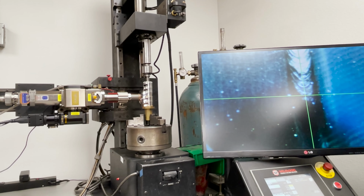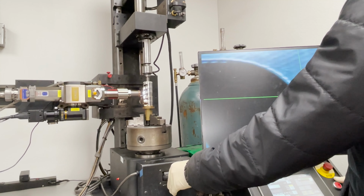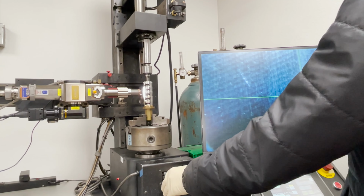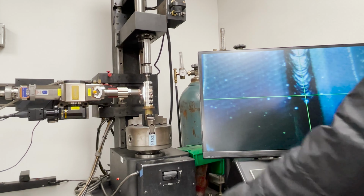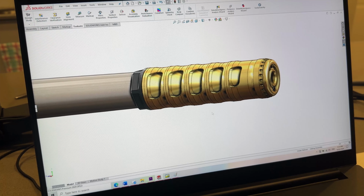In a typical conventional design, you're getting a rod of material and machining it from the outside with tooling, trying to create the geometry inside that you want from the outside. That's incredibly limiting and restrictive in terms of what you can do. Hence the TMB with the inserts, where we took the inserts and that geometry outside of the muzzle brake, made that, and then put it in. Same sort of concept, but this is far more practical and streamlined.